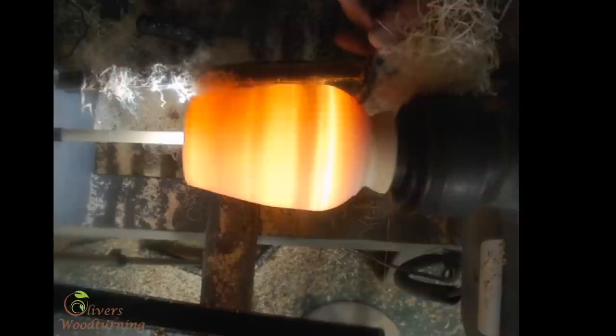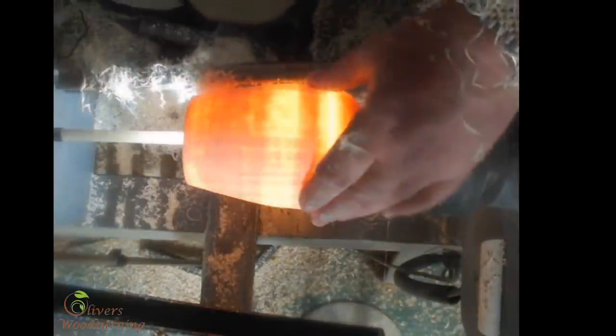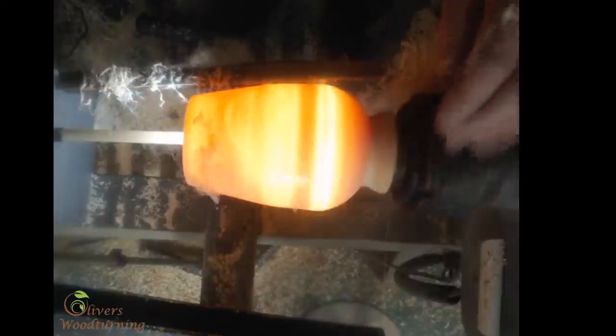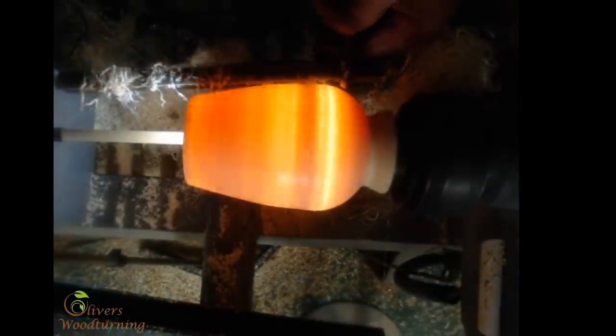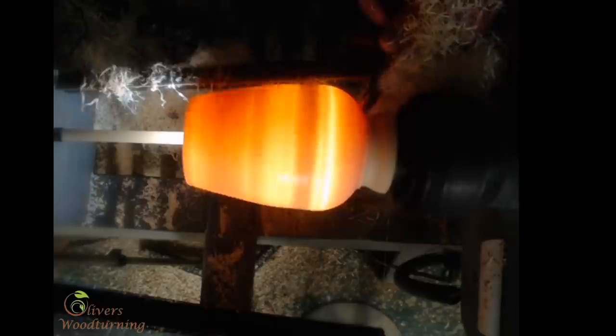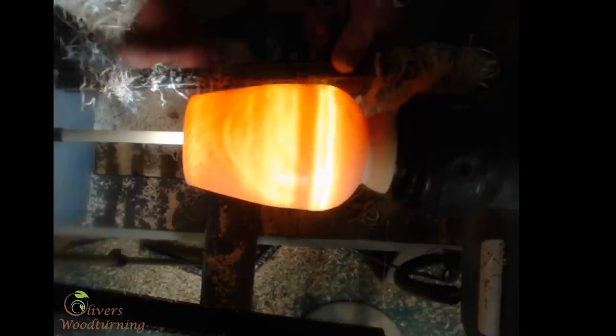I'm just feeding this gouge around the bottom. There. See how we run. Now, if I was doing this properly, I wouldn't be happy with this little bump here. You can see it, but for our demo, we'll have to live with the little bump, but I'm not happy about it. So, face full of water. Another little cut round here. There. Now what we're going to do is sand this, and the best way to sand it, you can see we've got a brighter light just here to here, so this is just a tad thinner. Before you sand it, turn the light on quickly.